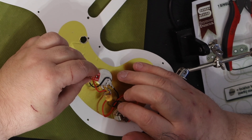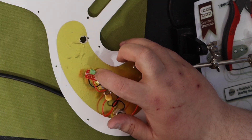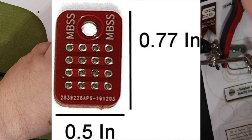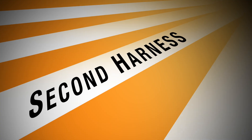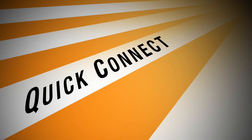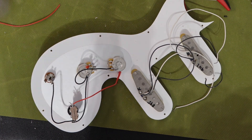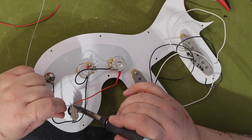You'll need a very small flat blade screwdriver, like what comes with an eyeglass toolkit. I didn't have one, so I took a throwaway flat blade screwdriver and ground it down with my Dremel until it fit perfectly. I also found small PC boards that I could solder the terminal block to — a package of 10 for $9.99, link in the description and comments. One mistake I made right out of the gate was installing the terminal block on the short side of the PCB board, which caused the harness to short out because all the lines in that row were connected. Once I installed the terminal block on the long side of the PC board, everything worked.